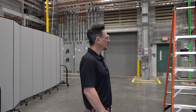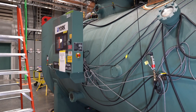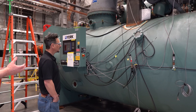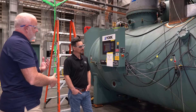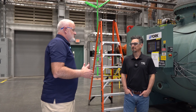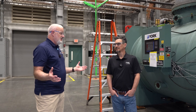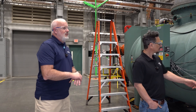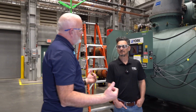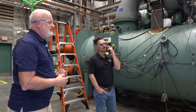This is a flooded, falling film, or hybrid evaporator. The predecessor to this product - the YKEP - had just a flooded tube design. We brought the hybrid falling film technology from our other YK products into this YKCP product. Those kinds of improvements only make sense when you're doing a major product revision - bringing that across as just an incremental change usually isn't cost effective from either a development or customer standpoint. So when we were redoing the product and optimizing it for new refrigerants, we said now is the time to introduce the falling film and pick up all the advantages we've already brought to other products in the YK line.